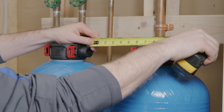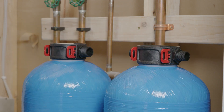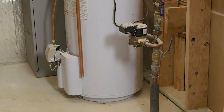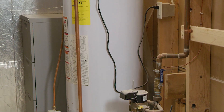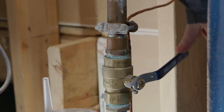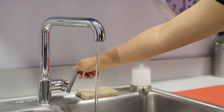Check for fit and accessibility, keeping in mind you will need to leave 8 inches between the pre-filter system head and each of the tank head adapters. You must install the pre-filter sediment system level with the tank head. Now make sure the area where you will be working is cleared and clean. Then turn off the main water line to the house and release residual water pressure by opening a downstream faucet.